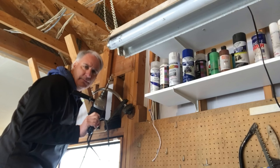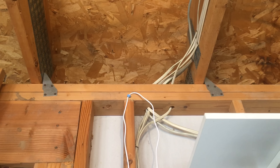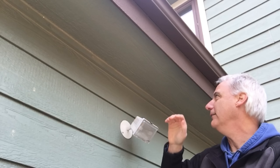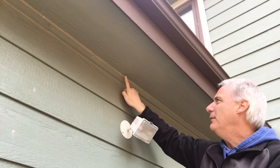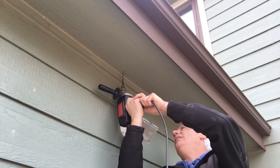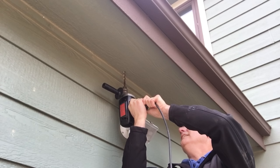Here comes the big problem: I can't drill down because of what's up here, I can't get it at an angle to go straight down where I want it. I know this stud is right here from inside, so I just want to be on this side of it. This section is hollow and I want to mount the camera about right here, so I want the cable to come right out and go right in. I'm going to go maybe an inch or so off, because I want to keep the camera away from the rain as much as possible.